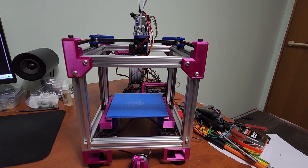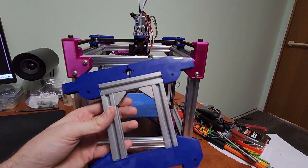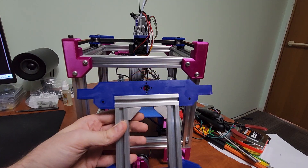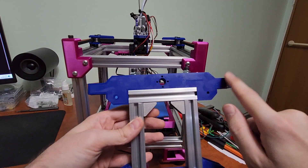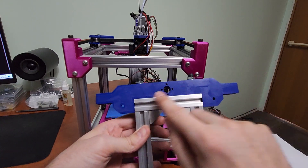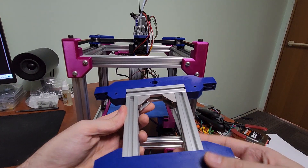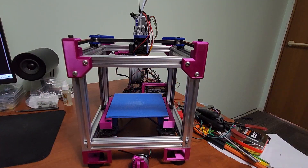I'm not ready to release the lead screw bed for the MK1 release. I did go with a much stronger bed using 2020s. However, the distance between the two carriages varies between printers, so this can't be one piece. I'm going to make a slit so they can be moved slightly in and out to adjust for your printer. Now that I know it wasn't the bed's fault, I want to do more testing before releasing it.